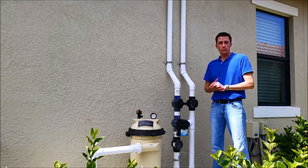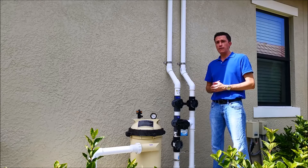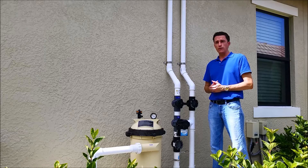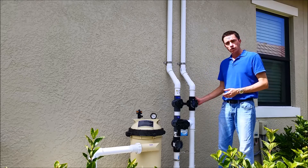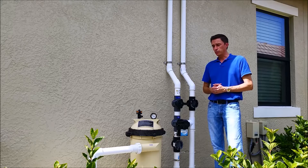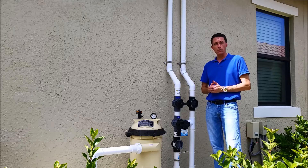This problem was caused simply by having a dirty filter. It got progressively worse until the bubbles got larger and larger in the pool. The vacuum relief valve on the roof wasn't able to close properly, and that lets air into the system, and that air goes back to the pool. I'm going to advise the homeowner to change out the filter and make sure it remains clean, and let the pool service company know that it needs regular cleaning to ensure regular operation of the solar.